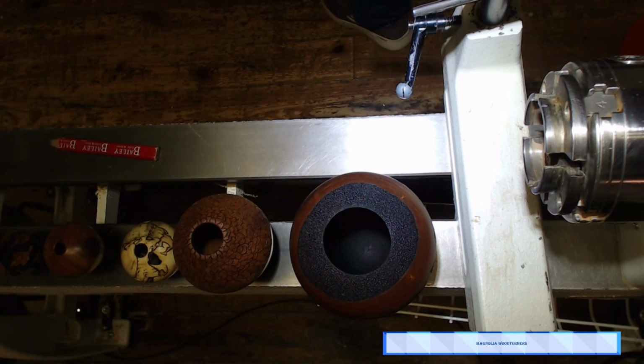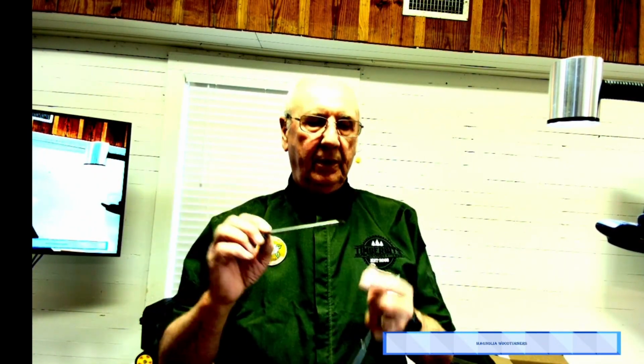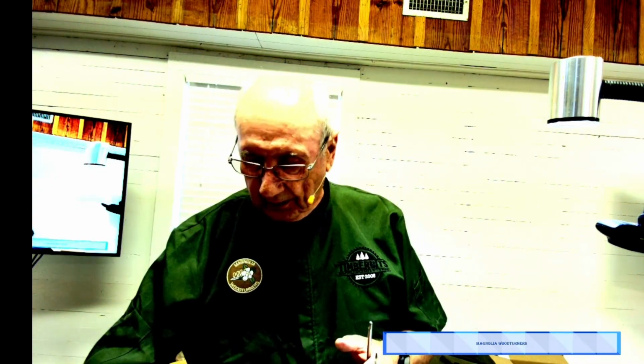And he has 2 different styles. He has a straight tool, which is what you really start with when you hollow. And they're round, they're very sharp. It's basically a scraper. And I'll talk about sharpening it later. But they work really well. And then he's got the hook tool, which is great for getting inside. So you can go in and get up in this area right here. So that's why I started using these.